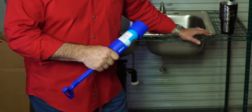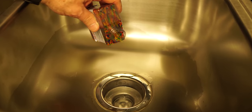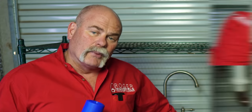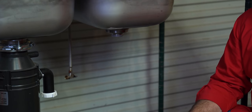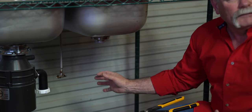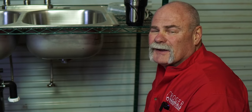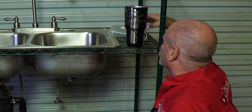So what we did, we took apart the kitchen sink here. We're going to redo the piping to hook it up like a single drain. We're going to pour Orbeez in it, pour water in it, let it fill up, and then see if this will blow it out. As you see, we've got the kitchen sink drain pipe taken apart. This would normally come down, go into a tee, drop down, come across, and then have the P-trap under there. We're going to come straight down on the tailpiece, then put our clear P-trap in. They've told me we're not shooting it into the bucket today. Let's start putting this together.